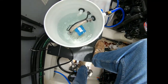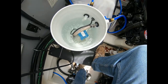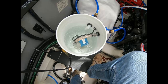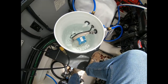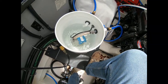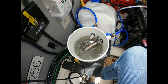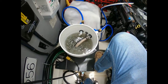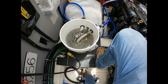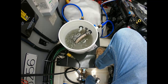You can see a little debris in the bottom — just some free-floating stuff from the heat exchanger. I'm now adding the barnacle buster and it's at 130. As soon as I poured the barnacle buster in, the clear water immediately turned this brown color — that's a good sign. This tells me we're starting to clean up all the junk in that heat exchanger. We're going to let this run for a while.